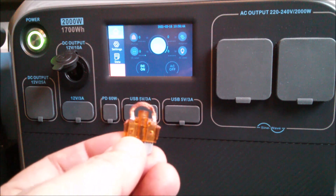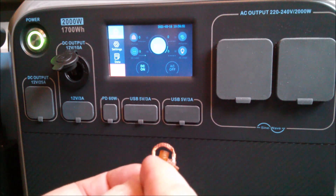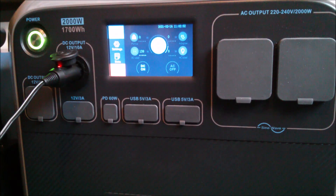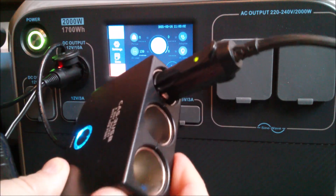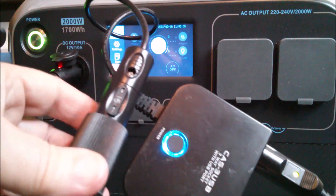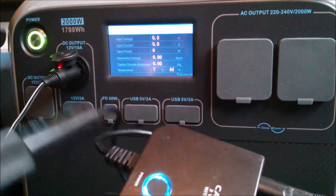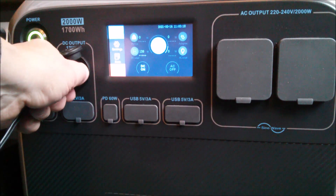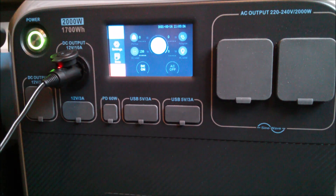Incidentally, I don't know whether you saw this on my desk - this is a fuse which I ripped the innards out of, so I tore all the fuse wire out of there and soldered a little piece of that braid across the exposed tips at the top. I think I've solved the problem of overloading this unit by adding another extension lead - I've got this one-to-three way cigar plug splitter. So that's added a little bit more resistance, so now I can run this thing pretty much continuously. Let's see if this plug gets hot.